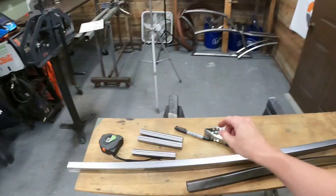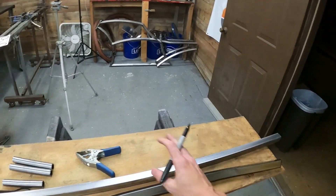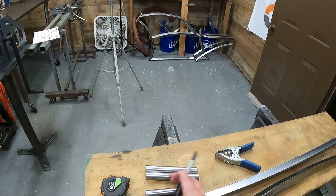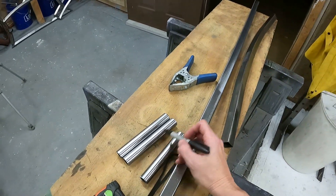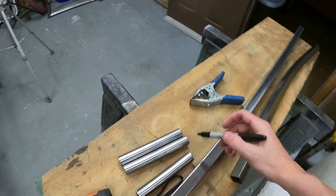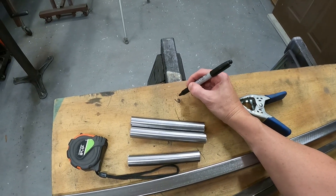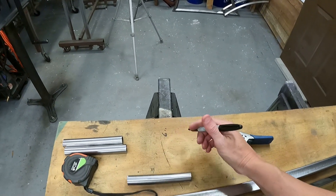All right, here's what we got on the table. I went ahead and did this off camera. First thing — write down the measurements. Grips are roughly about five inches long; most bicycle grips, even motorcycle grips, are going to run you around five inches long. So that leaves you about an inch to put inside the tubing. Cut your handle tubing at about six inches. Your steering neck tube, we're going to go five and a half.